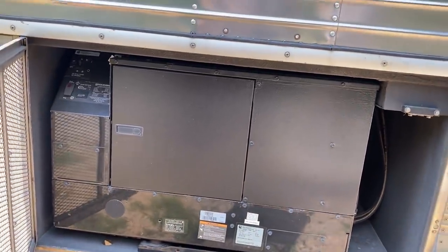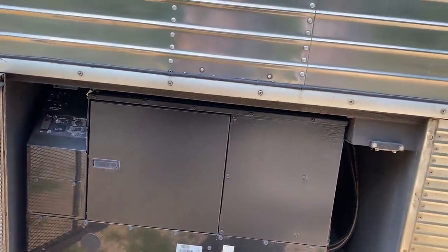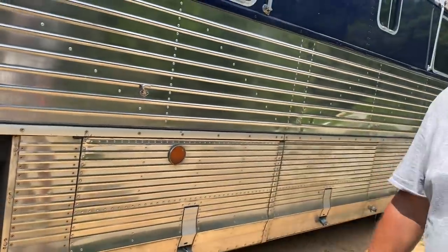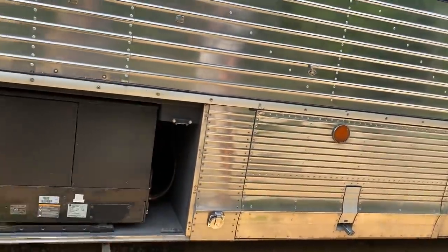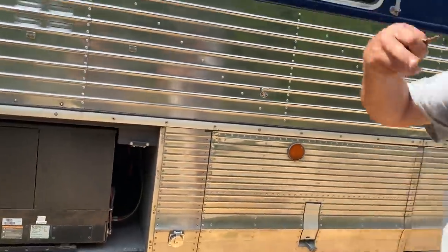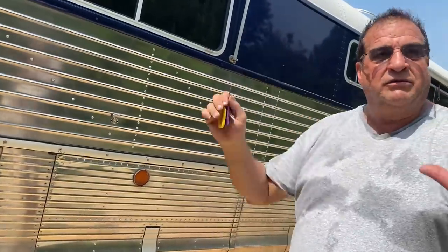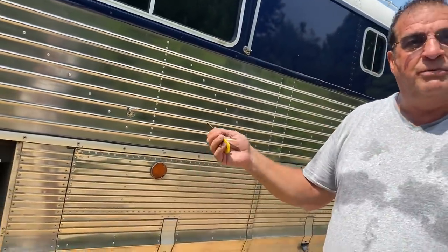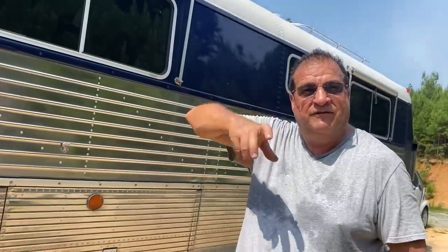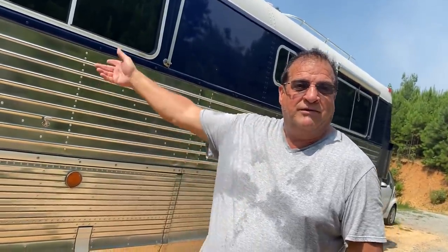10K, and that's a diesel generator. Yes, sir. And you said you had to cut the fuel tank four inches off of it and squeeze it together and then weld it back together? Yes. And luckily we did that, because inside the fuel tank was all corroded, the intake tube was messed up, there was a few other things, so we cut the bottom off it, put a brand new bottom on it. Also, we changed the flange on the filler cap so I could put a locking gas cap on there. Okay. That way you don't have to put a lock on the outside and all that. So, because the flange is one of those old style flip things.